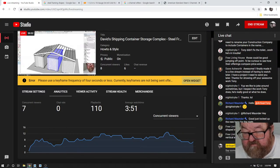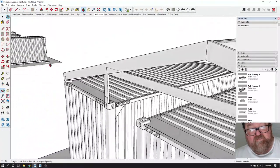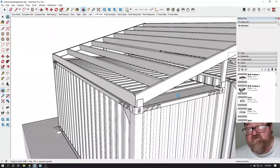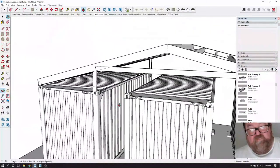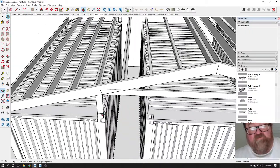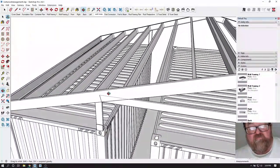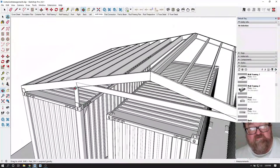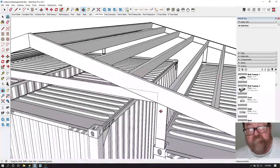I was referring to the vertical element. Well, I mean, again, I think it's going to look better if it's a C shape, because when you're standing on the ground looking at it, it'll have a thickness on both sides like that. And I'm trying to use commonly used materials, components. I know that the C channel, you're already going to have C channel on the job, and it may be that the engineer just says cut off one of these and stick it there. I don't know. Again, we're not engineering this, we're configuring it. It's a big difference.